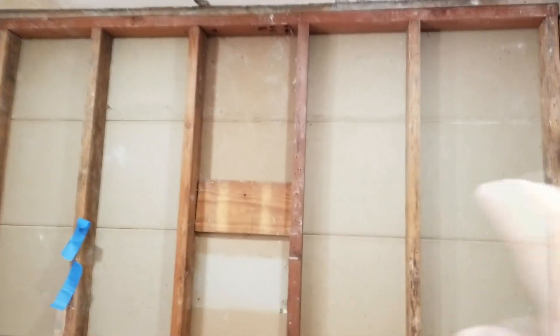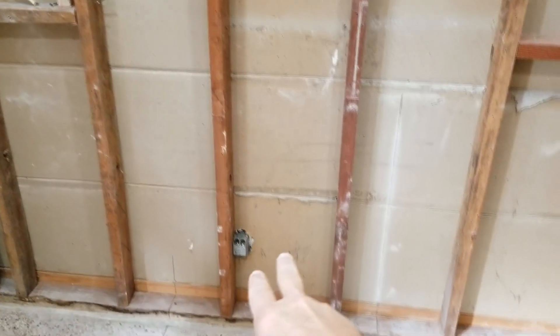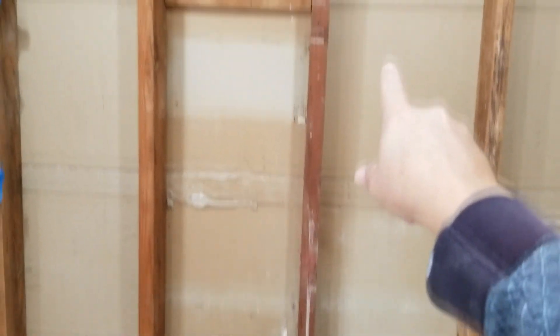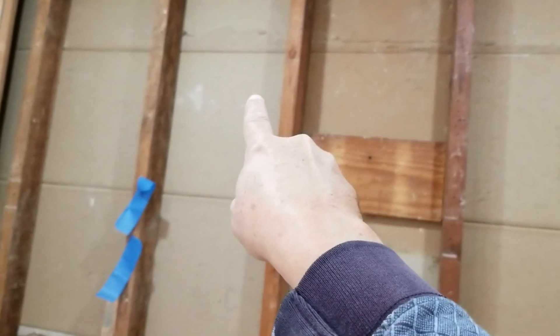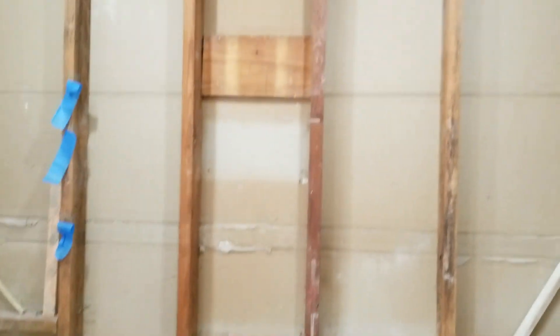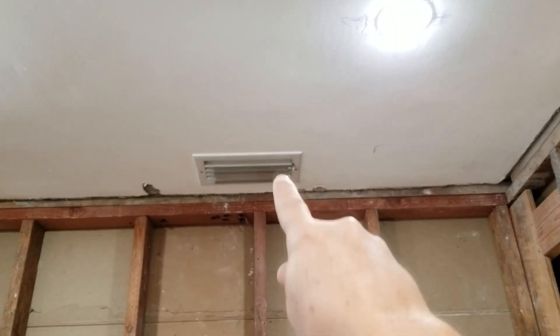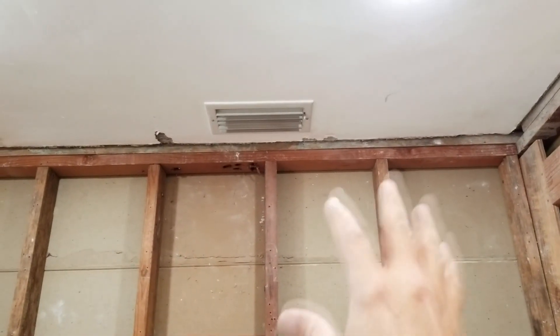Here's the kitchen where we're going to be doing the work. This is where an electrical panel used to be, and we've taken the wires out of this outlet. You can see where a line has been started here — that's going to be the right side of the doorway opening, coming all the way up to here. We're going to go over here and come back down on this side where you can see that pencil mark. We're going to be demoing all of this. We've already determined that this is not a load-bearing wall because there are no joists that end and rest right on top of it. Some go straight across all the way to the front of the house, but that load is being borne by the exterior cement walls on the front of the house.